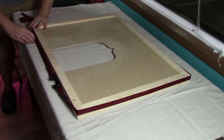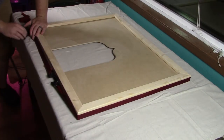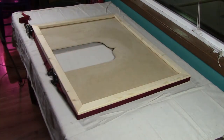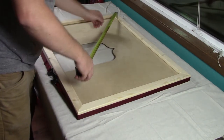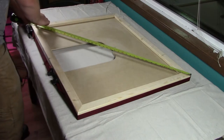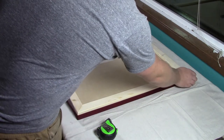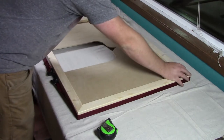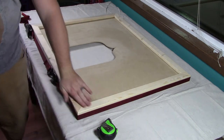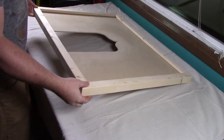Now it is time to put the framing and the MDF partition together. Wood glue doesn't dry very quickly, so take your time as there is no reason to rush. Place all of the framing pieces around the partition and line up the corners as best you can. This is the part where we clamp everything together. A lot of the strength of a glue bond is determined by the clamping pressure used — a strong, even clamping pressure will help ensure that your project will not fall apart. This is especially important when you will not be using screws or nails. As our framing is made out of 2x2 material, we can simply use a ratchet strap. Make sure to run it nice and flat all the way around the frame, use the ratcheting mechanism to clamp it all together tightly, making sure it doesn't slip off and that the frame isn't out of square. Once clamped, check that it is square by measuring the distance from opposite corners diagonally across the piece — if the two numbers match, it is square. Once done, walk away for a couple of hours and let the glue dry.